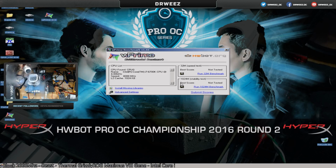What I'm going to do is get to minus 177, but I want to get there slowly, and then I want to hover there ever so slightly before I start, just to give the chip time for the temperature to get through. So then minus 177. And I'm just going to stay here for a little while, and wait for the temperature to drop a bit, or to climb a bit, back up to 176.5. Give it another little splash, and then we're going to run. Okay, let's go.